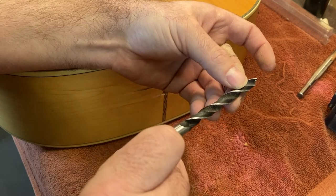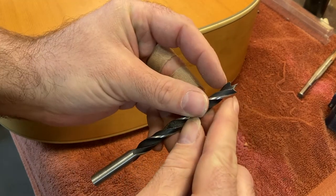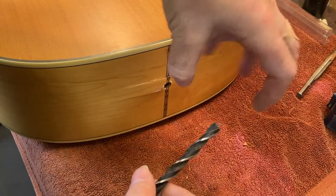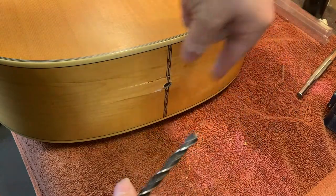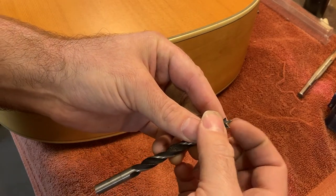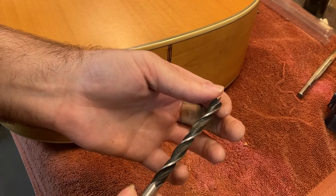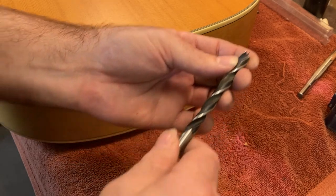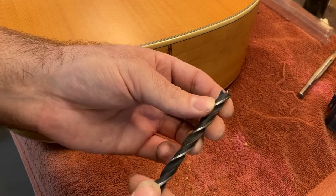You figure out where you're going to put the hole, put a little punch in it with an awl or even the tip of the drill bit, then put that tip right into that hole and drill. The way this cuts is that it cuts from the edges first — kind of an auger action where it twists around where the hole is going to go, cutting from the side kind of like a reamer would. Then as it goes in, it engages the little blade surfaces and starts cutting similarly to a twist drill bit, but it creates that little buffer first by severing those wood fibers before trying to pull them out using the twist method. This is a fairly safe way to go.